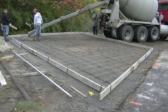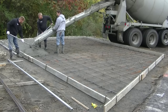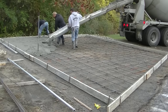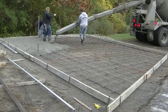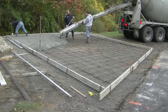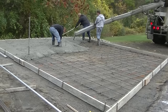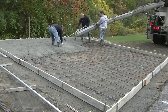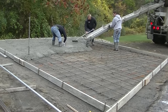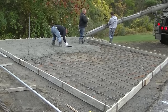You don't have to put a bolster under every single cross member — once they're all tied, the rebar grid is actually pretty rigid, so you just space them out accordingly. The next day we ordered 4,000 psi concrete with air entrainment, which helps protect against freeze-thaw damage, plus water reducer for slump control so we can pour a looser slump without adding water. I also put fiber mesh in everything I pour — the microfiber goes through the whole six-inch thickness and helps with micro-shrinkage cracking and holds the surface together.